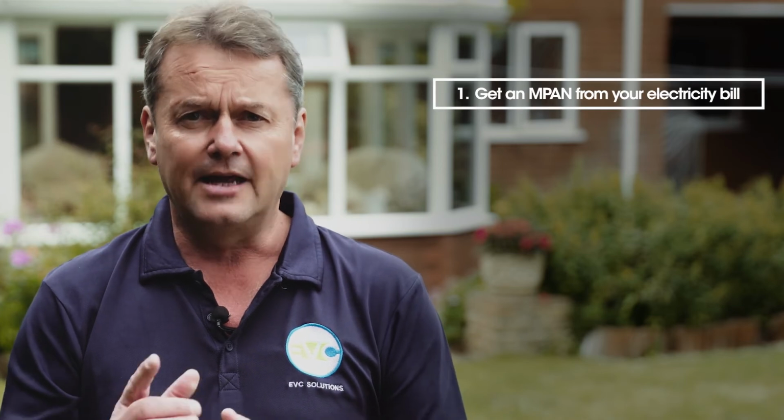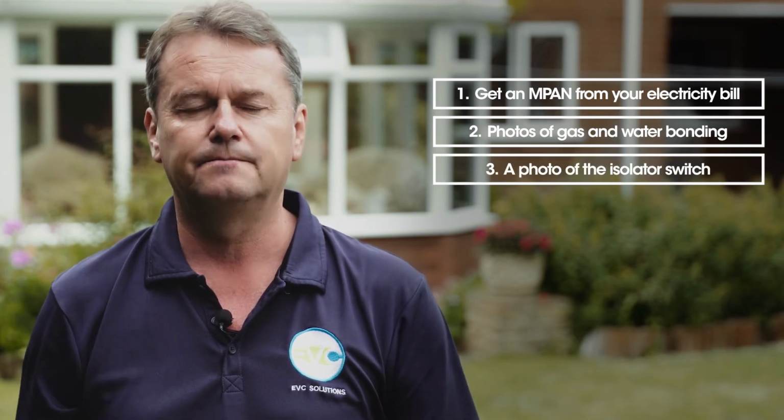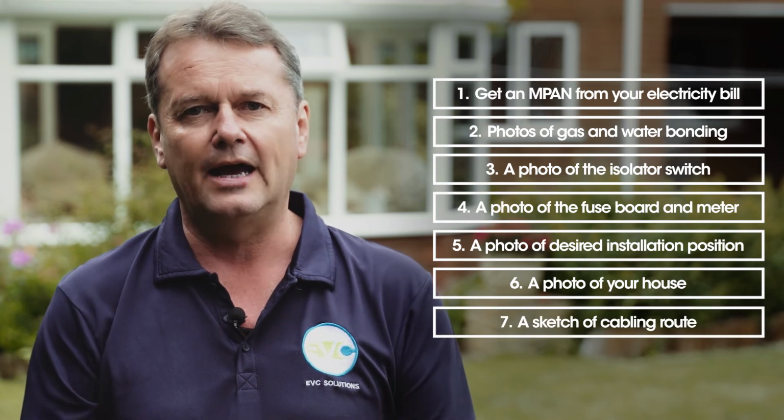This seems like a lot to do, so here's a quick checklist. 1. Get an MPAN number from your electricity bill. 2. Take photos of gas bonding and water bonding. 3. A photo of the isolator switch. 4. A photo of your fuse board and meter. 5. A photo of desired installation position. 6. A photo of your house. And 7. A sketch of your house floor plan.